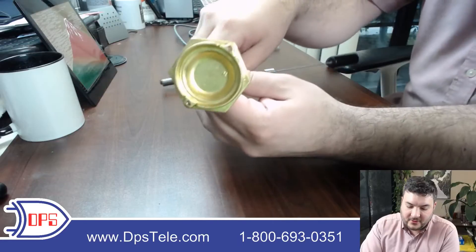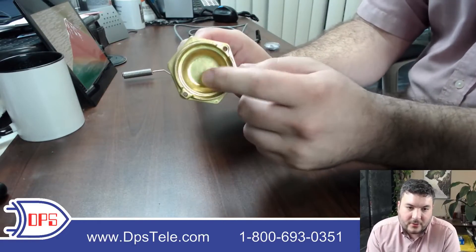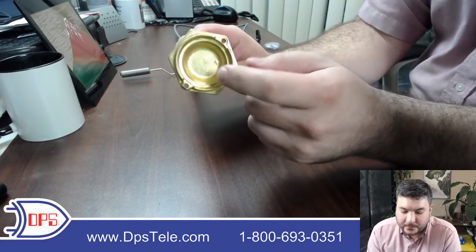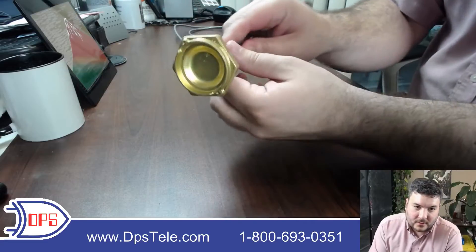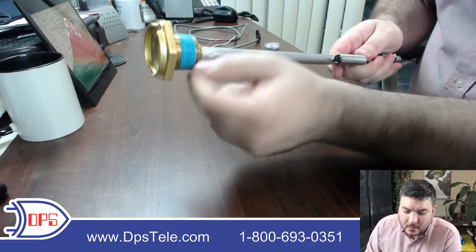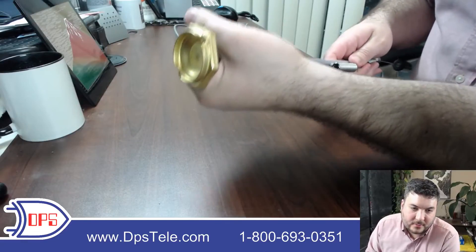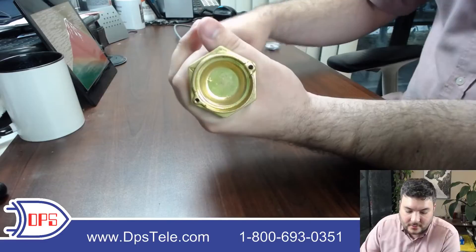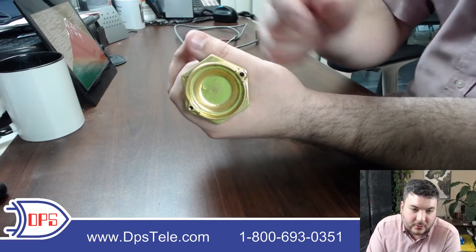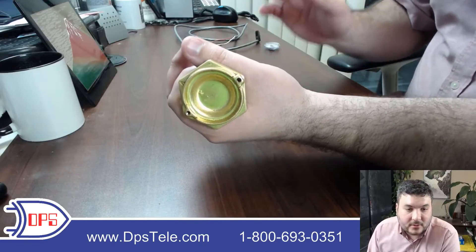When it reaches the top, that shaft terminates just underneath this brass hexagon here. What's happening is a magnet is rotating just underneath this plate. If you look at the threading here, this is for the port at the top of your tank — you'll just have this protruding from the top. So this is an airtight, sealed interface where the magnet reaches through and controls the gauge. You already have this in your tank most likely, and we can continue to use it.